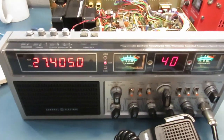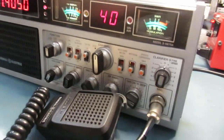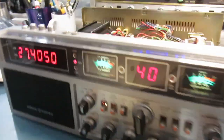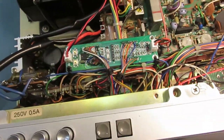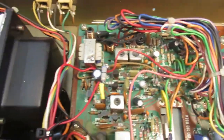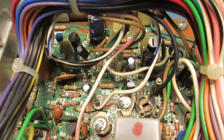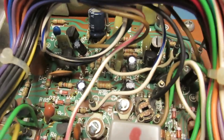Okay, so there are some technical aspects. This radio is just about there. What do you think? Yep, I think so. Got her all wrapped up, tuned up. This guy puts out about 13-14 watts sideband and 5 watts of AM with good swing. I replaced those capacitors over here in the audio circuit as the microphone preamp was shorted out, and that's working great now. Went through all the tune-up procedures using the manual.